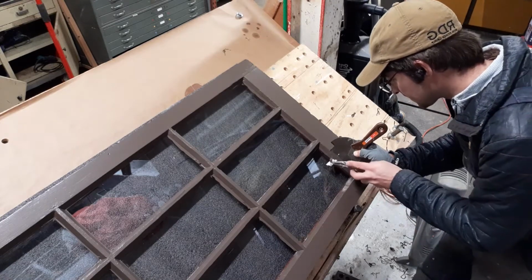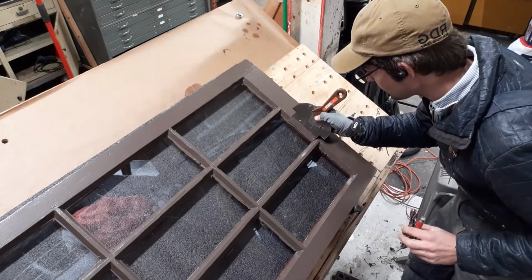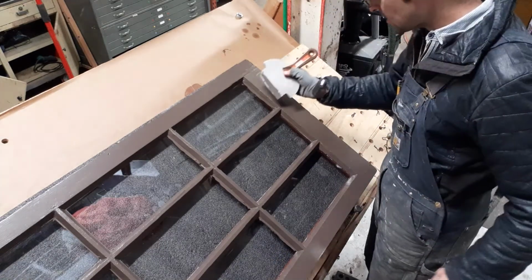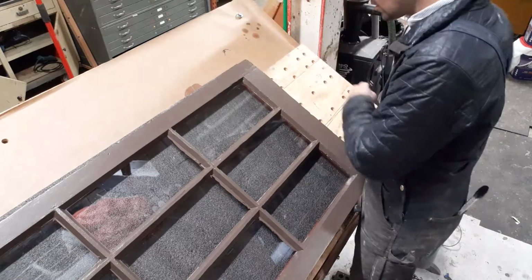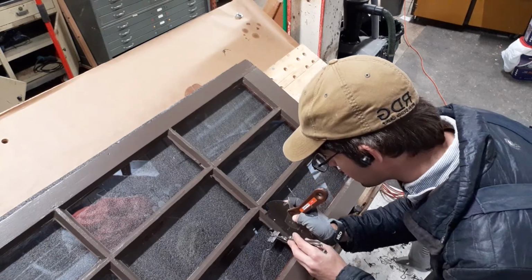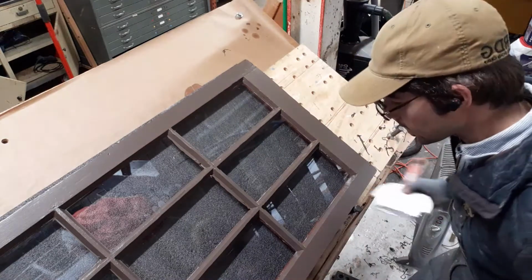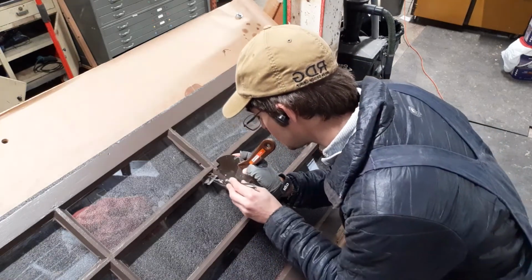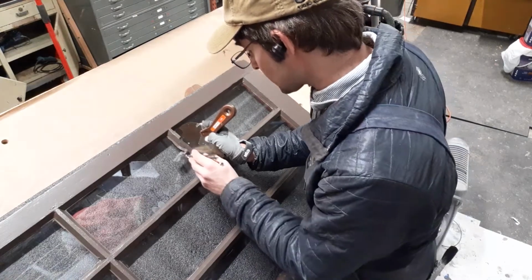Another important thing to consider is transportation. If you're doing this at your house, you can do one window at a time, set it aside, let it dry. But say I'm bringing 30 windows with me to a project, I'm gonna have them stacked up and strapped down and all that jazz, and latex is notorious for scuffing. I don't see it as a very durable paint. I just see it as an easy paint. It dries quick, it's easy to clean up, but it is not very strong to abrasion. And that I don't like in regards to windows, because windows are functional. They endure a lot of weather. And they're a much more complicated system than just a simple windowsill or a jamb or brick molding or the sorts. The sash goes through a lot.